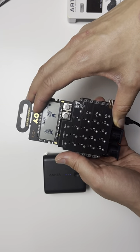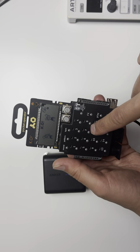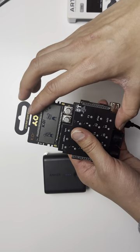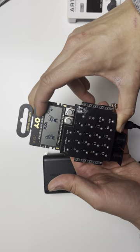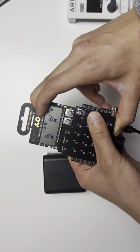The reason you have to squeeze them is to make sure that the pogo pins on the top PCB board are making contact with the pocket operator buttons. The way I'd suggest doing that is by putting pressure with your thumb like this, holding it, and then squeezing it together with your other hand.